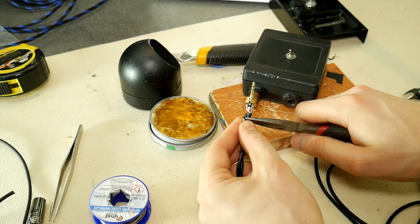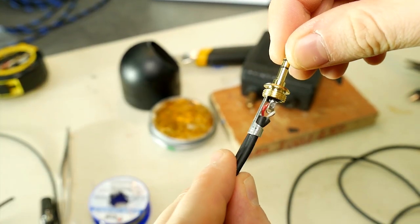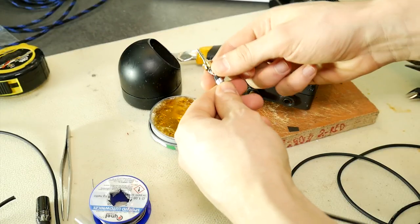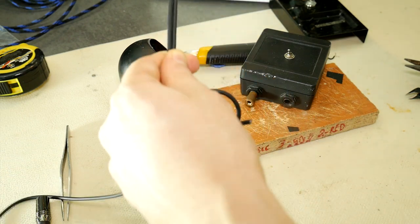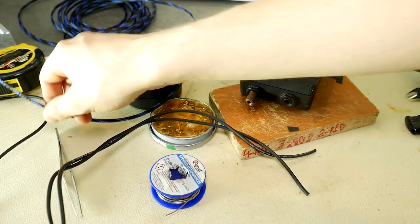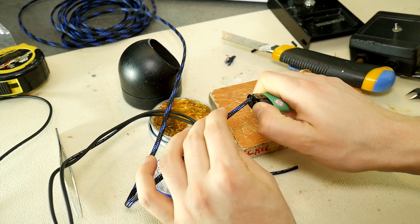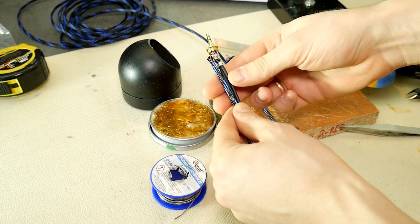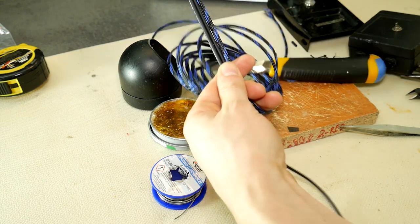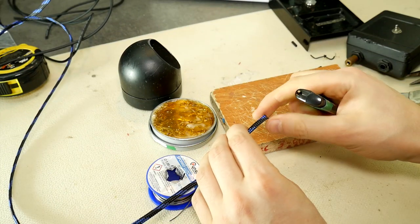Take the pliers and push the cord into the connector space provided, but squeeze carefully so you don't damage the cord itself. If you have soldered the three wires to the 3.5mm jack correctly, then you did everything right. Now pull the wires straighter for the next task, which will not be easy. Take your chosen color expandable braided sleeving, cut off the end, and if it's frayed, burn the end so it does not tear further. Measure the length of braided sleeving needed, but don't go all the way to the very end, because at the end the cable divides into two parts. Burn the other cut end as well so it does not tear apart.